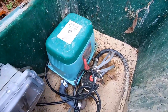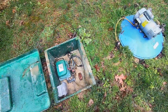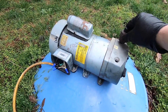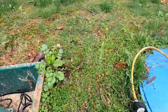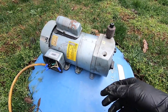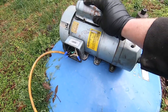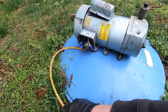You're going to have one of two different types of pumps. There's one like this which looks basically like a big fish tank air pump - it's called a diaphragm pump. The other type is called a rotary vane pump, which is more common. Inside the rotary vane pump there are carbon vanes that spin to pump the air. What usually happens is the vanes will break and lock the motor up - you might hear the motor humming and it might be really hot. Sometimes it'll pop the capacitor inside. There are two screws holding the cover down with a little capacitor underneath.